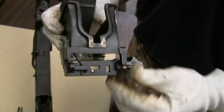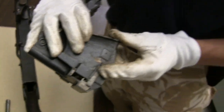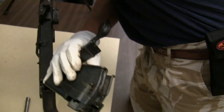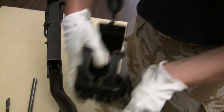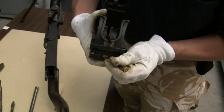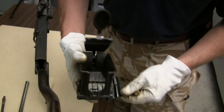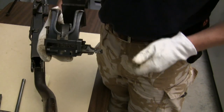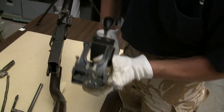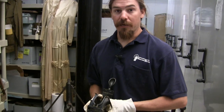One last element to point out: in order to disassemble this mechanism, there's a little locking piece here — slide that up, then push this spring-loaded button in, and you can push all of the little guts of this mechanism out through the side. I'm not going to do that because I think it would be a nightmare to try and reassemble here on a museum examining table. You can only imagine what happens if you have to disassemble it to clean it on, say, Iwo Jima in volcanic dust.